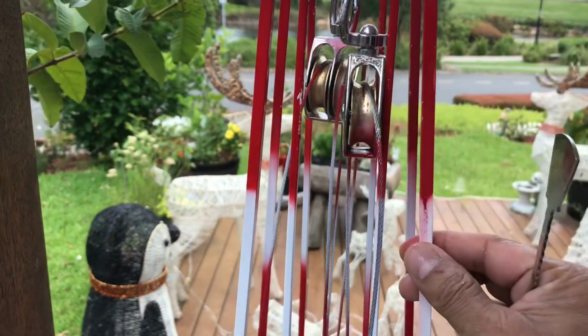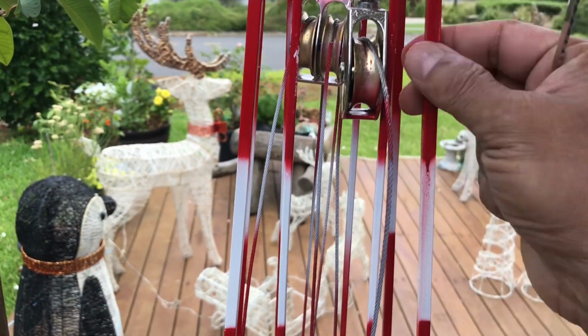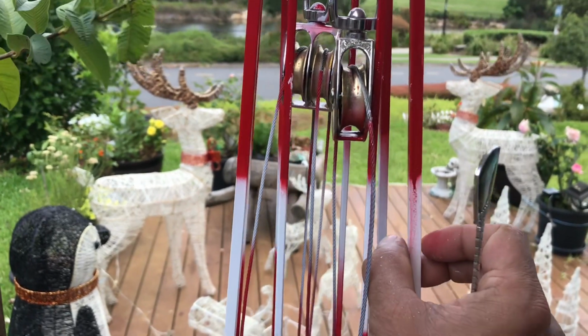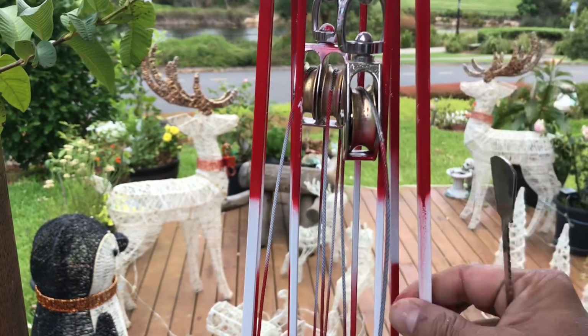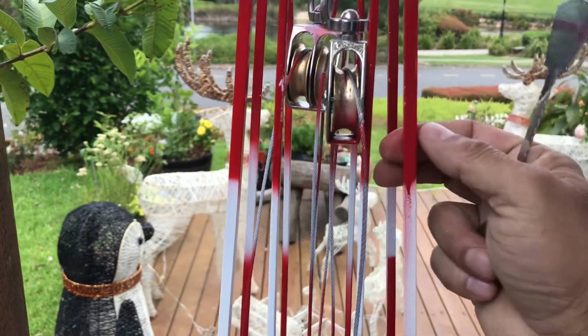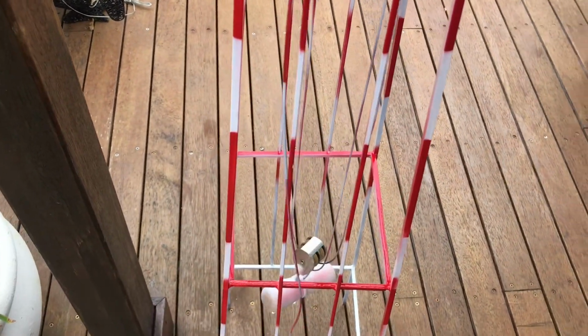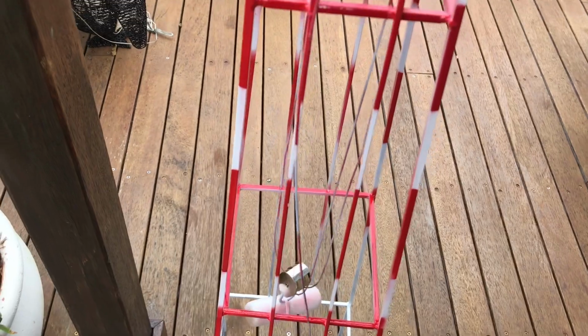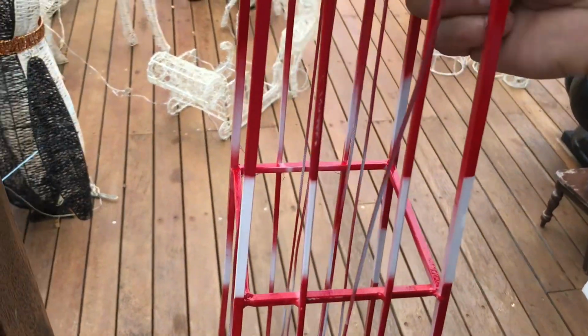So imagine if this was say 5 mm, that means you have a lesser capacity of this drilling mast. If you have 10 mm or maybe 50 mm, 100 mm, that's where you go higher and higher, because your main objective is how much you can lift from here. So don't get confused with horsepower, guys. How much you want to lift is what determines your rig mast capacity and your drilling rig capacity. It's not the horsepower or the number of engines. You can have 5 engines, you can have 10, doesn't matter.